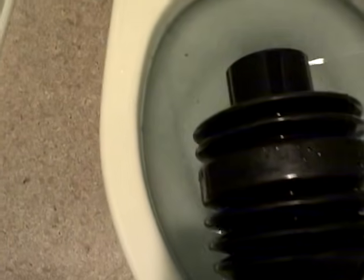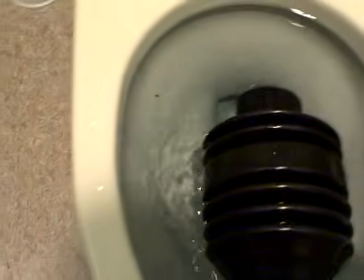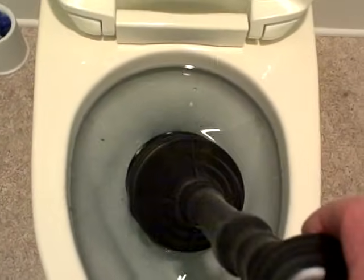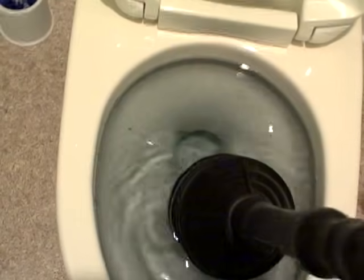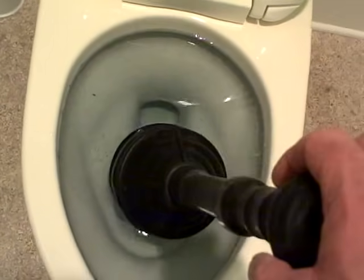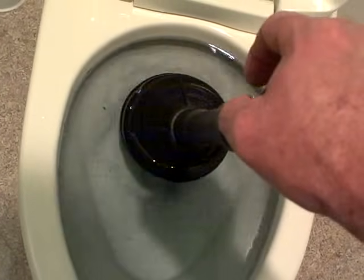So, what you want to do is slowly set the ball in and let the water just kind of run up into the end of it and fill up slowly so you're letting it go down. Then you push the end of the ball plunger down into the toilet, slowly squeeze it down, very slowly come back up, and then pump it kind of short a few times. You still might splash a little water over the side, but sometimes you just got to make a mess — we're going to try not to.